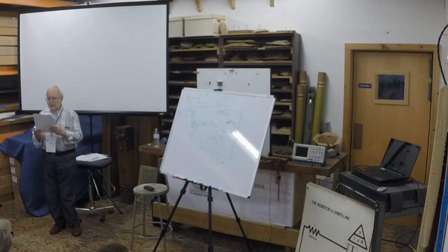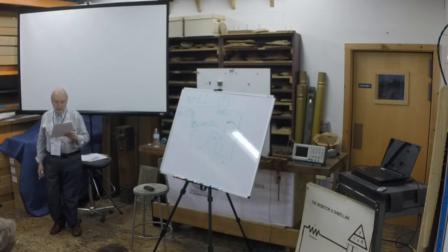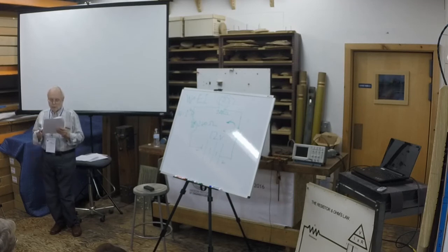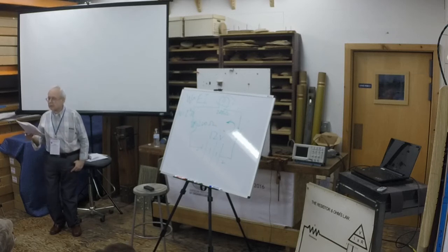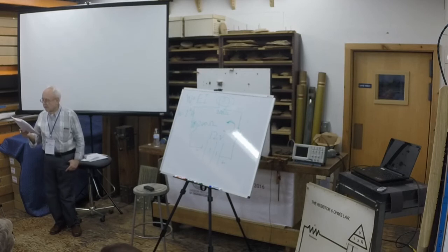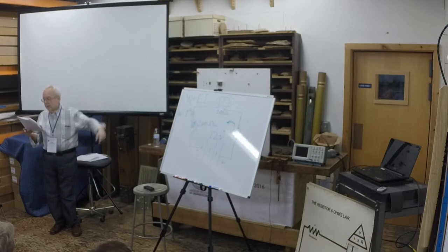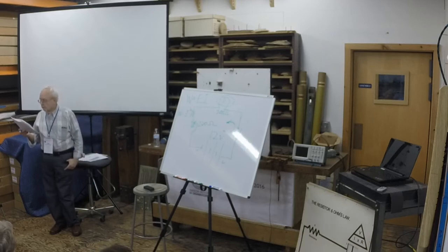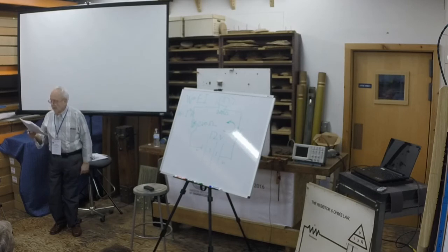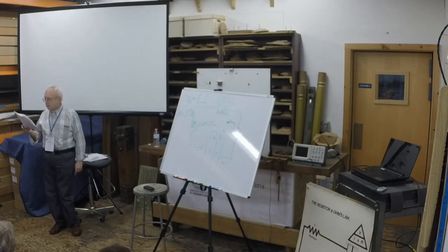Turning back to our earlier example of 25 slider motors drawing 70 amps, after having figured out how large the rectifier needs to be, the next thing to determine is how big the wire needs to be between the rectifier and the slider solenoids. While losing electricity in a wire on the way to the Sforzando lamp might be desirable, losing it on the way to these big solenoids certainly isn't. After all, you've paid big bucks for the solenoids, and you need power.